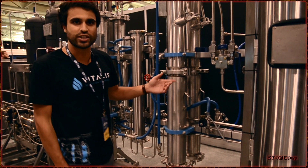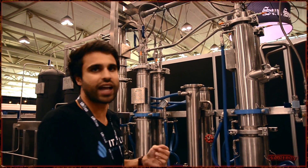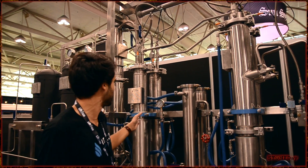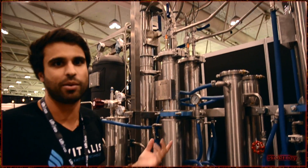There's going to be a little bit that makes its way through, so we have a secondary separator. Anytime you're having this amount of flow and this amount of pressure, you're going to have a little bit that goes from the first to the second one. But the first will grab about 85% of your cannabinoids, and this will grab the extra 15% that you don't grab in the first one.